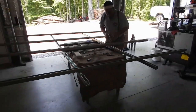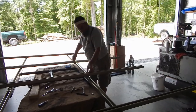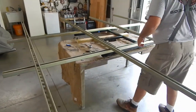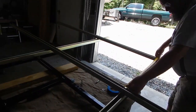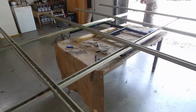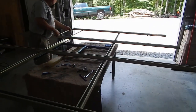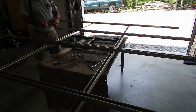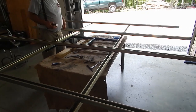Here's a little update — it's kind of dark. Marky G showed up, finally, four days late as usual, but free help you can't beat. What we've done so far: we've laid out all these unistruts, matched them to the panels. Next we're going to lay the panels up here, make sure the bolt holds and the back sides of the panels fit inside. If you can get a panel on the bottom and a panel on the top and everything's square and even, you can lock them down.